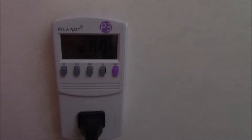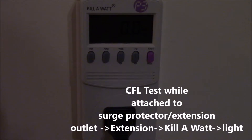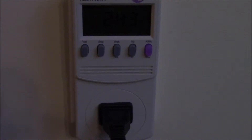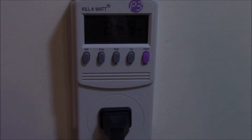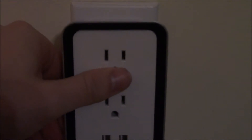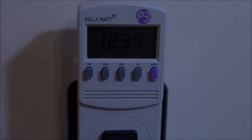Part of the reason I did this was because the space heater is rated 1500 watts and never gets that high — it's off by almost 10%, so I was worried the kilowatt just wasn't accurate. So I tested it several times with different configurations — plugged up to a surge protector, extension cord, or splitter. This shows the different combinations you can plug up: wall outlet to splitter, then kilowatt, then the actual light. It works just fine, though it takes a little longer to reach maximum wattage via an indirect connection.